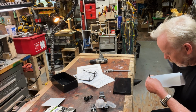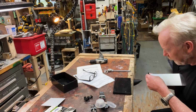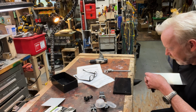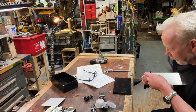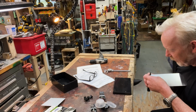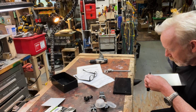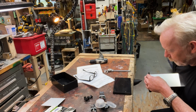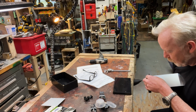All right. Square holes are a very frequent thing you need for electronics projects. And they can be a real pain in the ass. A notcher makes quick work of it. And there are lots of different kinds of notchers. I find them in general to often be, like the old ones that Radio Shack used to sell were very poor quality. But this black kind I find is the one I like the best.